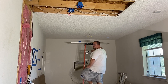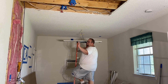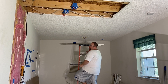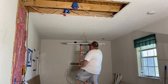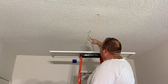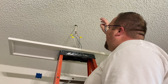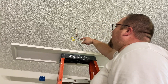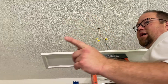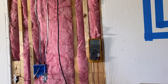This house strikes again. I'm trying to get everything wired up because I'm closing these up and putting drywall behind it, so I want to make sure everything works and the circuitry is alright. Problem is, just like everything else in this house, it's not right, not to code. The switch is usually not powered, but in this case it actually is powered — I don't know how or why. Neither the white nor the black is right, so I had to do some switching, check the resistance on both sides with the ohmmeter. Now we've got it fixed.